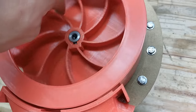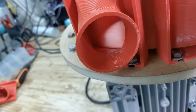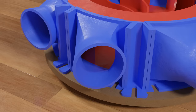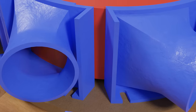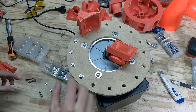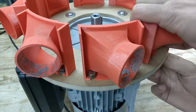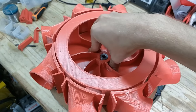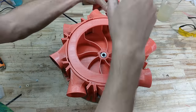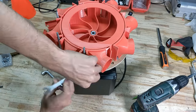If I were to print out a fixed stator, I'd run the risk of it being too small or too big due to printing tolerances, thermal expansion, and whatnot. The idea was to design a stator that could be manually adjusted so that I could get it to be precisely the right diameter. To do that, I have eight separate stator blocks and eight spacers. The stator blocks have two slotted holes which allow them to slide back and forth radially. The spacers guide the stator blocks but also force air to go through the stator blocks. After drilling some holes, I bolted down the stator blocks to the mounting discs, getting them as close as possible to the rotor, making sure they never actually come into contact with each other. Then I bolted down the spacers using threaded rod, which clamps down the top disc. This disc makes sure all the air is going through the stator blocks and helps hold everything in place.